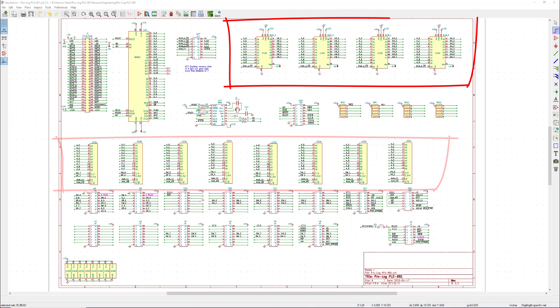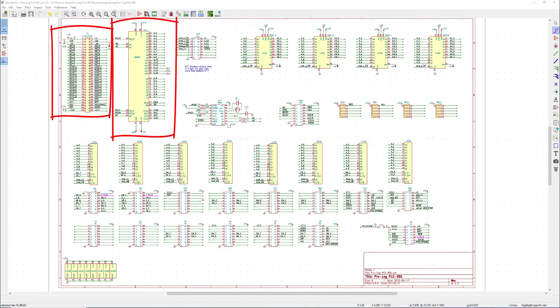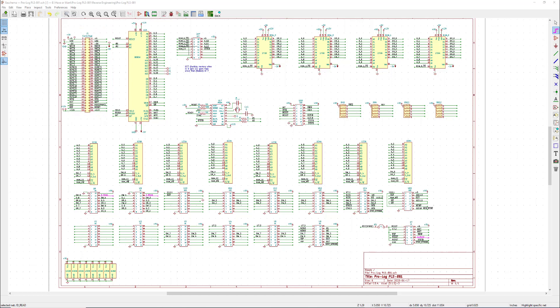We have 2708 EPROMs, the 8080, the edge connector — I just put in a generic cartridge connector, but I did save it in a project library because it is specific to this device. We also used standard crystals, individual capacitors, resistors, and 4.7k common rail resistor packs. These were all placed in the normal manner, pulling components out of the library, duplicating them, then putting in the component ID from the silkscreen.